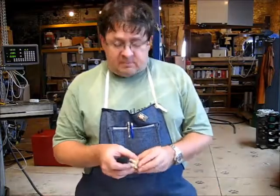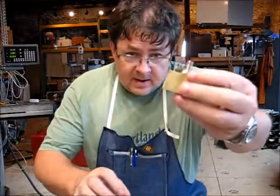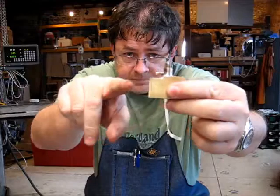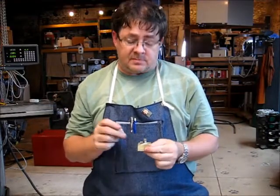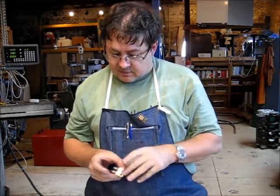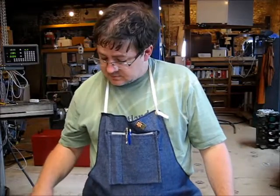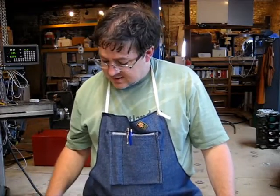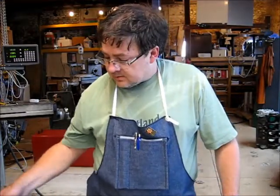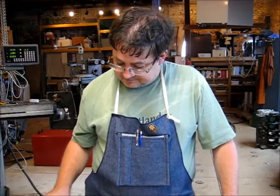Alright, I had a little camera problem soldering on the needle valves, but I did get the needle valves soldered, and I decided to mill a relief on the two blocks to give room to hook the hose up to the barb fitting rather than space the needle valve up with any kind of washer. That's not reflected in the drawings, but sometimes you got to make on-the-fly decisions. Anyway, I had a little camera difficulty, user error, to be honest, when I was soldering. But they're on.